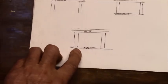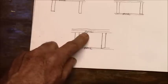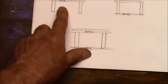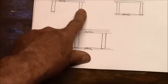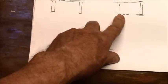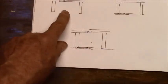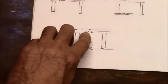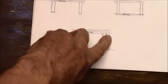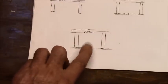Here I've done a combination of the two systems — using foil right beneath the floor bouncing heat back up right away, plus a blanket of foil beneath the floor joist. This might be advantageous if you have a damp crawl space where moisture can get at your floor joist. If you're using pressure-treated floor joists it's not an issue, but having the foil beneath prevents any moisture from getting into your floor system. On that standpoint alone this would be more advantageous. If you want to spend the extra money on foil, this combination is a winning choice — you're bouncing heat right up into the floor and protecting the floor system.